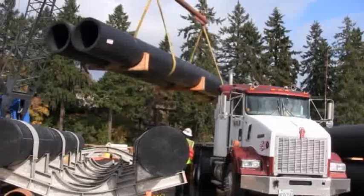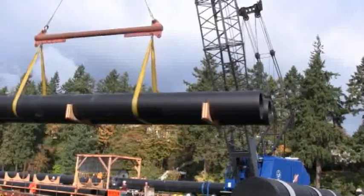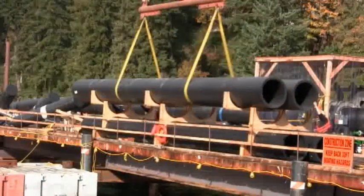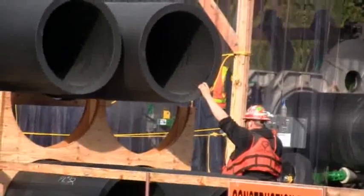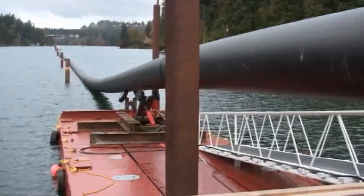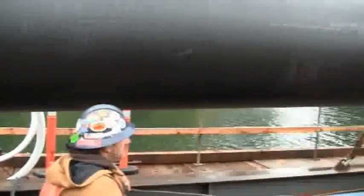The lake full phase of the Lois project is ongoing, and the star of the project has arrived on the lake — the pipe itself. The Lois system is comprised of roughly 330 sections of 50-foot long, high-density polyethylene or HDPE pipe. HDPE was chosen for Lois because of its 50-year track record in severe marine environments. For this project, two million pounds of HDPE pipe must be fused together in lengths ranging from 200 to 1,300 feet to form the Lois pipeline.